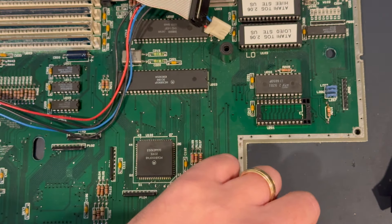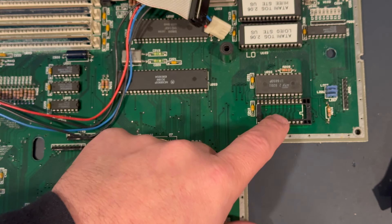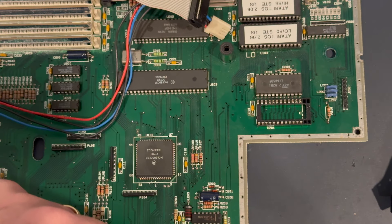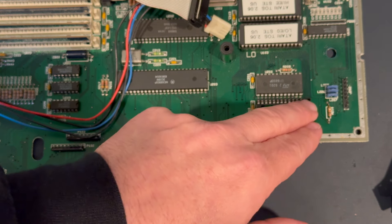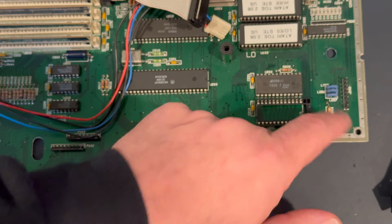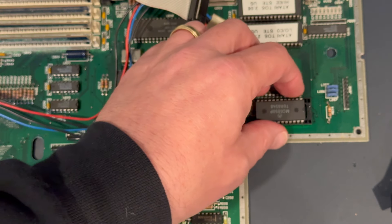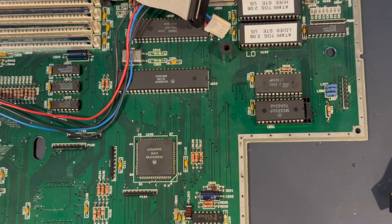So I did a bunch of testing. My educated guess is that the 6850 chip connects and works in tandem with a controller on the keyboard in order to make the keyboard, mouse, and joystick function. So I removed the chip in question. The socket isn't exactly the right size — four extra empty pins — but it fits in the area with room to spare. I popped out two of the pins on the other side, and I actually have two salvaged 6850s from another Atari ST. We'll pop this guy in and make sure it goes in properly.